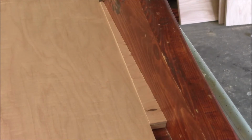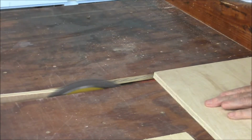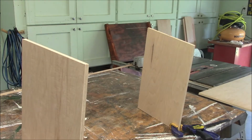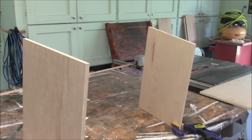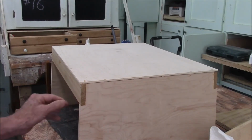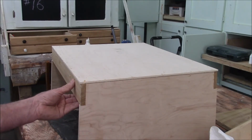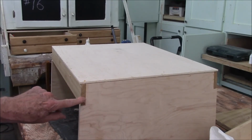I have a wedge in place. I got our new legs. They're at 10 degrees instead of 8 degrees, and they're about 10 3/4 inches tall instead of 11.5. I kind of like having this solid wood brace across here, but I don't have any more cedar in stock, but I do have some poplar, and I'm going to plane that down to 1/2 inch.